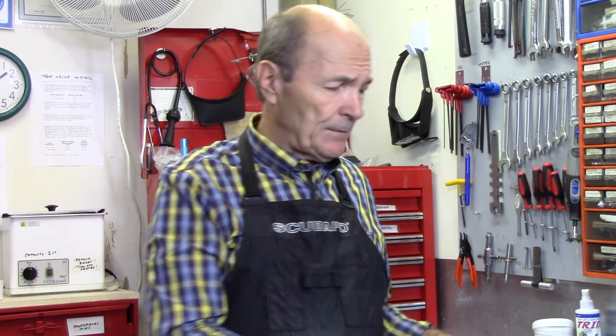So that's good, right? However, there's something else about high-pressure hoses that makes them different. High-pressure hoses are under extremely high pressure, 3,000 PSI. When you turn your tank on, depending on your instructor, and maybe you missed that lesson, but it should say, turn the valve on slowly. Did you catch that word in your lesson when you learned to be a diver? Turn the air tank valve on slowly. Why? Well, a couple of reasons. First of all, if there was a mistake made in the mounting of the regulator or something else is wrong with the regulator, you'll hear hissing right away, okay? And the other reason, if you turn it on very slowly, the hose is not suddenly under pressure. If you watch when you put your regulator on and you turn the air on, you'll see that all the hoses move a little bit.